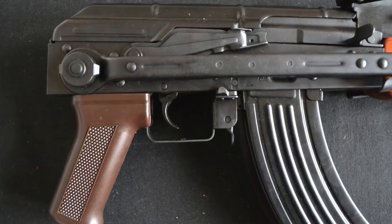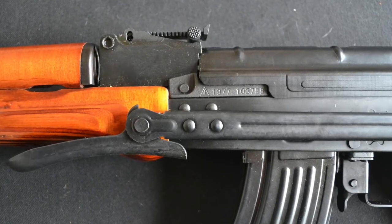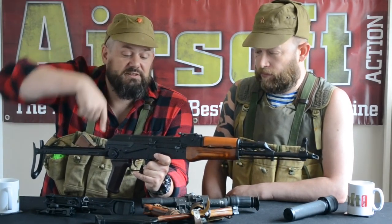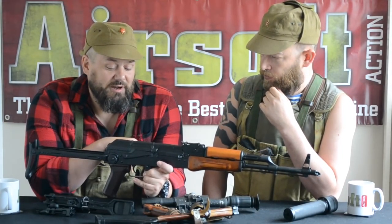You can still see them being used by Russian Special Forces and Russian militia units today. The biggest difference with the AKM and AKMS over the original AK was that they went from a forged and milled receiver to a stamped steel receiver. With forging, you start off with a semi-molten lump of metal whacked by a big shaped hammer, then use a milling machine to cut away material. With stamping, it's a thin sheet of material pressed by a great big tool that puts all the bends, cuts, and folds in.